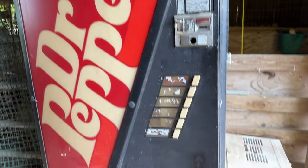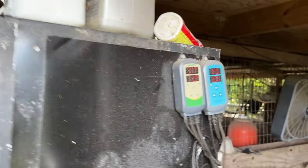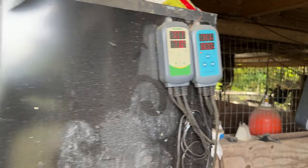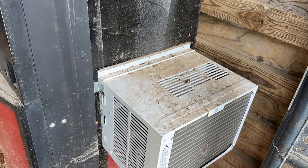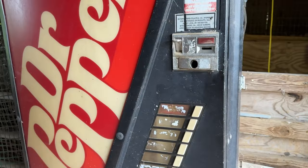As we're waiting for our vermiculite to dampen down, this is our germination chamber. These are our thermostat and humidity controls. This is an air conditioner I bought at Home Depot for a hundred bucks. The Dr. Pepper/Coke machine was something I had sitting around for about 10 years - the cooling unit wasn't fixable - so I tore all that out, gutted it, put a big hole inside, put the air conditioner in, put the controls on, and it works amazingly well. You could do the same with a wood box.